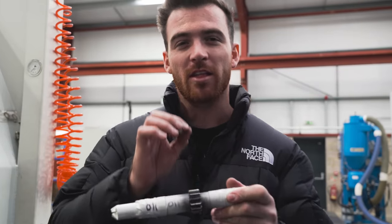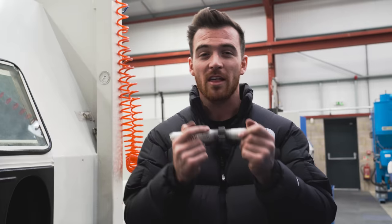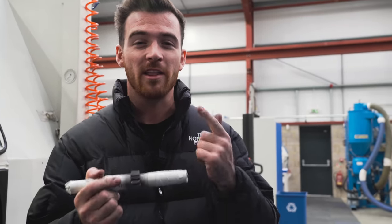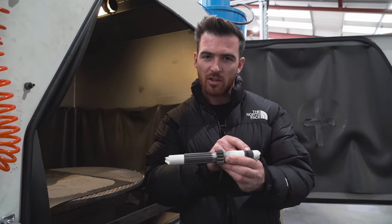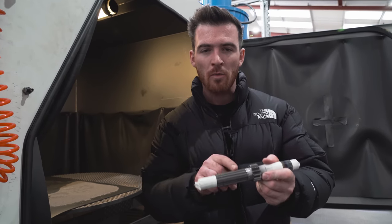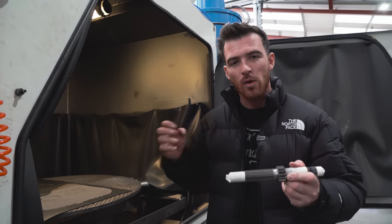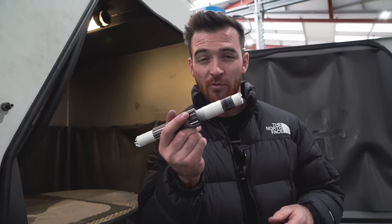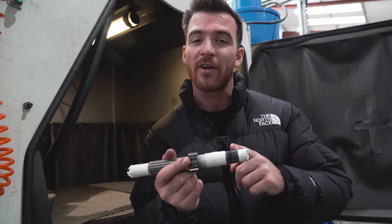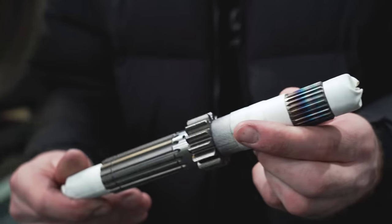This has made a big difference, especially under a microscope. This is the first step to getting that really smooth, super hard polish finish to make sure these gears are super strong and run super efficiently when they're inside the new engine. Back again with the shaft — we've unmasked this part and want to super finish these surfaces. There's no point firing really big balls at a very small radius part like this, so we'll go in with a much finer media to get into every single nook and cranny. We should see this discoloration go and the finish come up a lot nicer with a nice matte finish, ready to go into the final process.